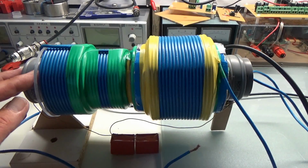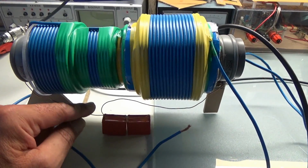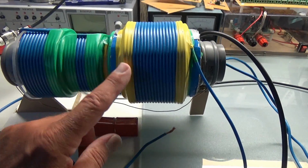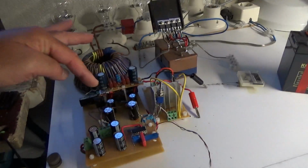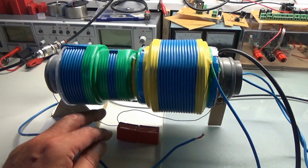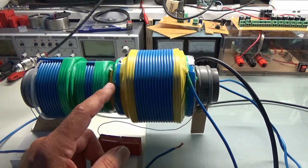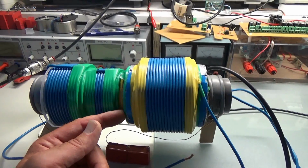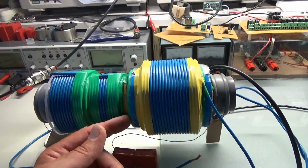I tried the setup with this 200 turn Tesla coil being put in resonance by a series cap, something like those small Wima caps here, instead of the inductor series resonance. So I just fed the push-pull from the yoke into this 200 turn Tesla coil with this series cap, and pushed the nanopulse through this shorted coax around the lower end of the grenade, but the effect was very minimal. The transfer to the grenade was very low, something like 20 volts, so not able to light any bulbs.